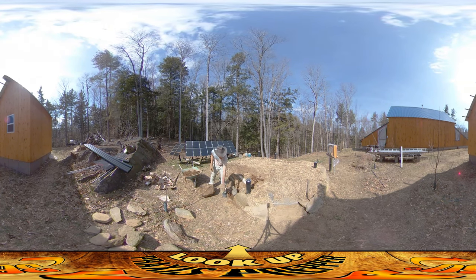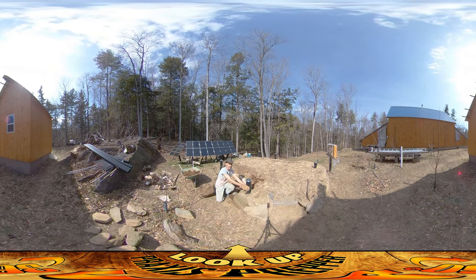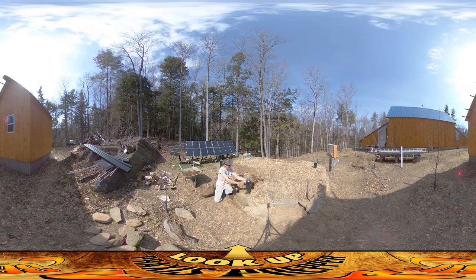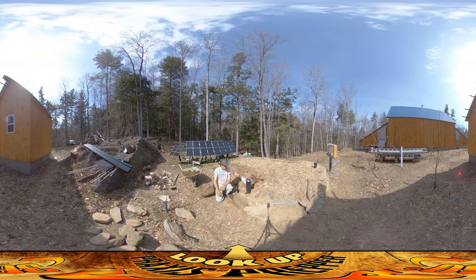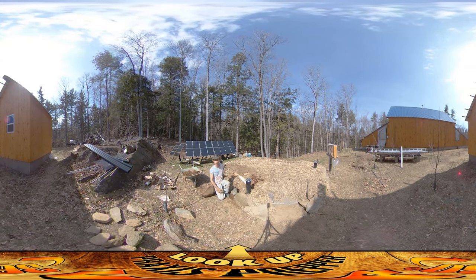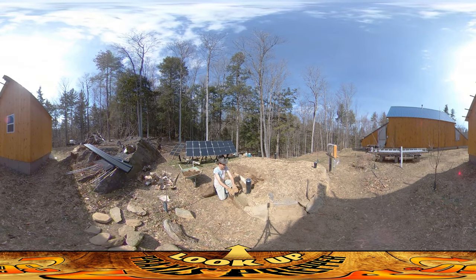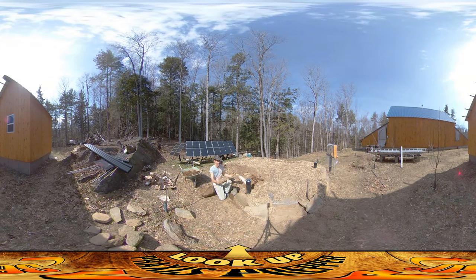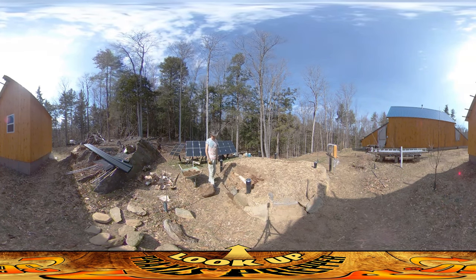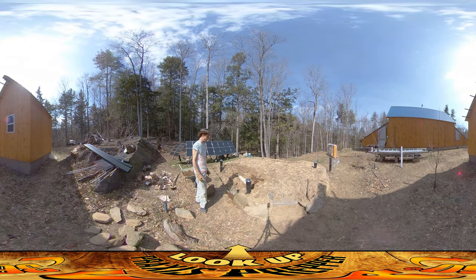I was initially thinking about just letting this slope off, but I'd have to bring the slope so far over because of these guys. If I had it sloping here, there'd be more weight on this side than on this side — it would tend to push these guys out as everything settled. You can either make a wall and have it be pretty tight, or I'd have to bring the whole thing over and have all this extra fill out to maybe here and then start sloping it down. So it was going to be a lot more dirt and work. I figured a stone wall looks nicer anyway, and it's probably about the same amount of work because I can terminate it a little sooner.